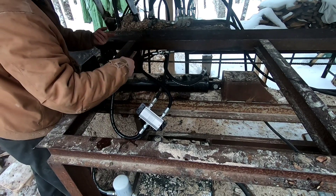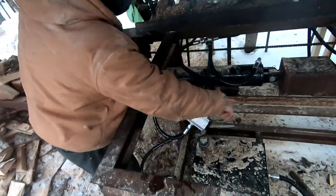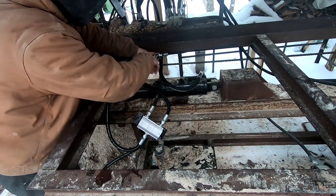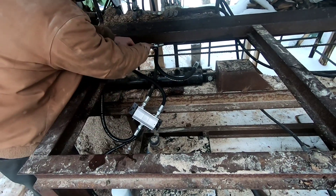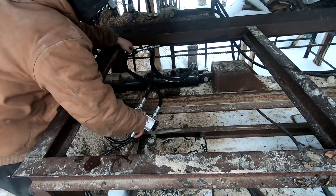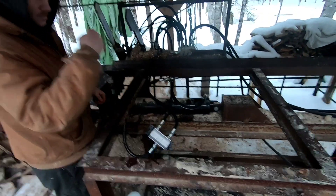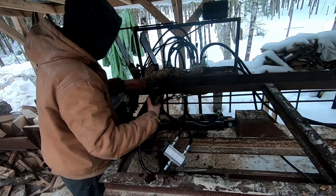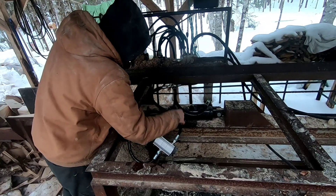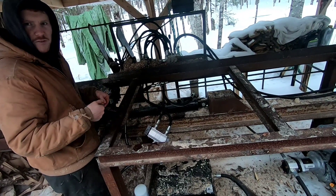For the return — so when the cylinder is coming back, the flow is coming down here and around. And then when it gets up to the return flow, it tees into the return and tees back. So it's not quite as good on the return, but it splits, and the half comes back through this way too. The out is definitely a full regenerative circuit. But the return, depending on where the flow splits out — with the gear in here, it should pull 50% of the flow. So when it tees, I should get my return back the same way.